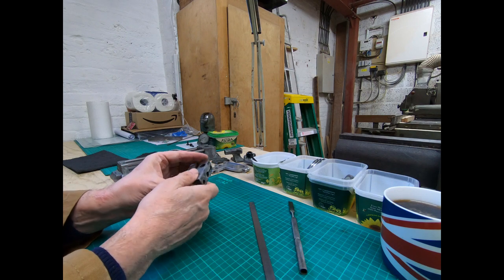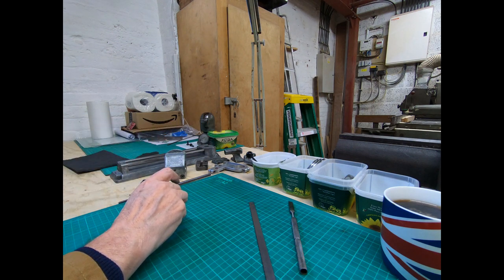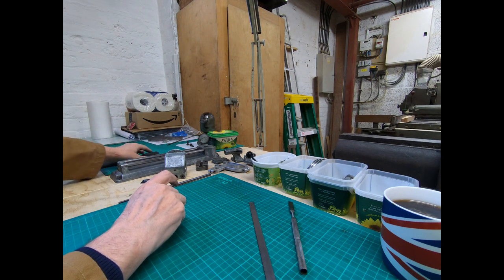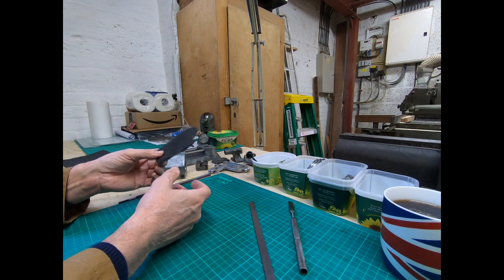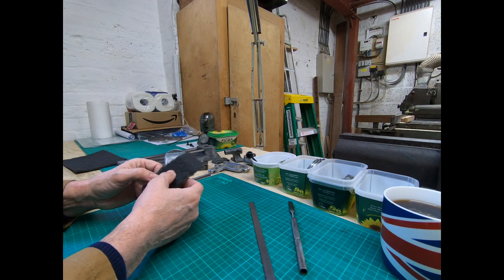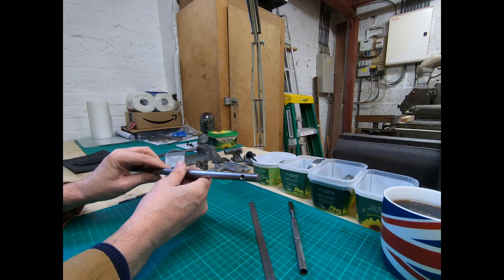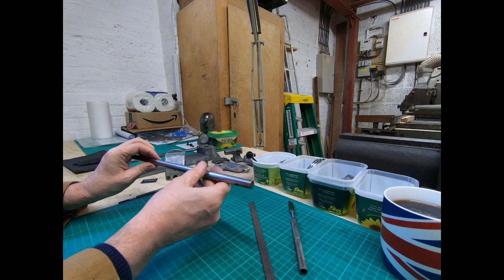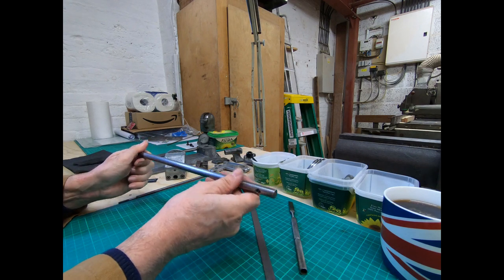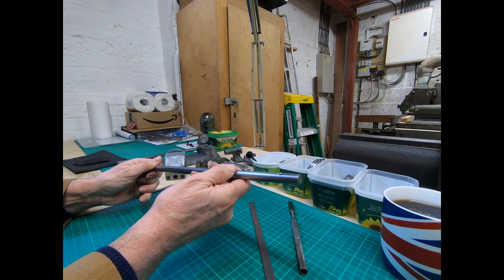That appears to be the only true steel part, so all these bits were relatively easy to do and I did the majority in a day. I went with the ultra-fine Scotch-Brite - I tend to keep the semi-worn-out bits because they seem to do slightly less damage. I went very carefully over the ways and just removed any muck on there. I'm going to polish those a bit later on in the process, but at the moment this is just the first clean of the component parts.